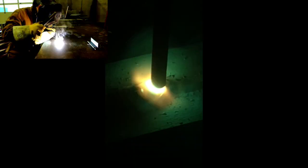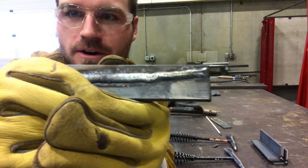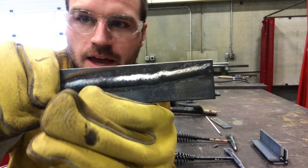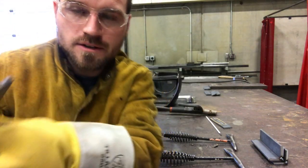I struck up on the edge of the plate and here I'm moving towards the puddle very quickly. I do my hook, come back to the center, wait a half second, and start moving. Notice that I'm welding over my previous tracks so I end up with a nice clean weld. You can see the tie-in here — it's not perfect but there's no dip where it comes together and I was able to continue the weld on.